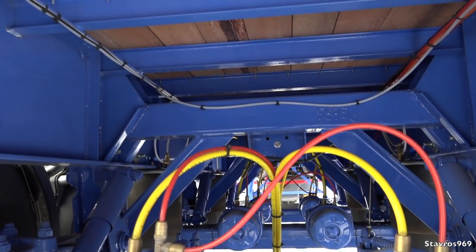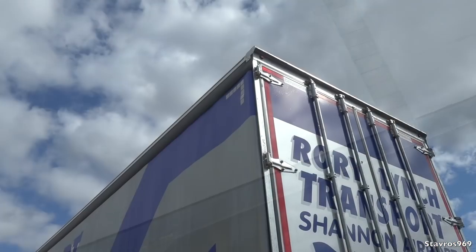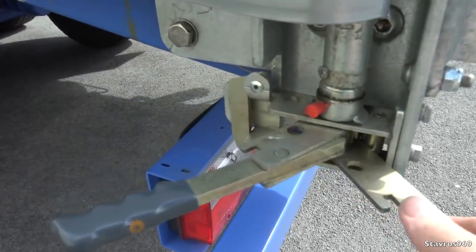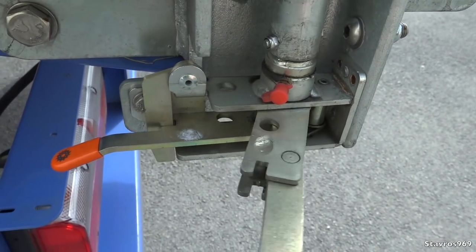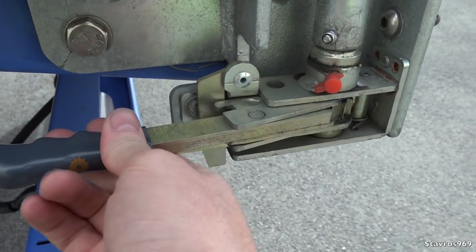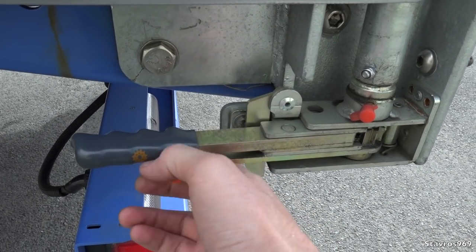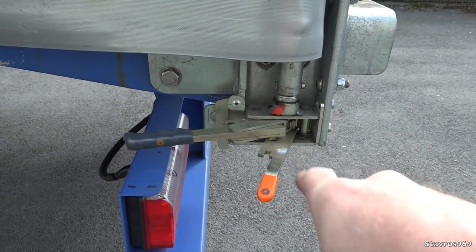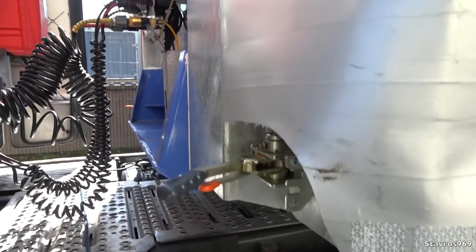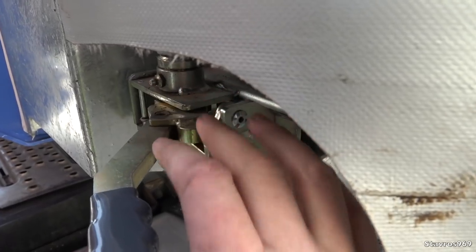It's pretty good to be able to see underneath and that floor — how long before the first forklift goes through it? The poles are very easy to operate on the curtain sider. To close it, you just tighten that back in, pull the ratchet — there's also a grease nipple here — and tidy it in and clip it. To open it, just pull it open. Let's have a look at the front pole and the susie layout on the front of the trailer. The ratchet on the front is more or less the same system as the back — pretty easy.